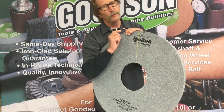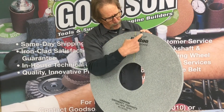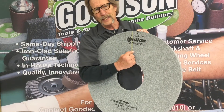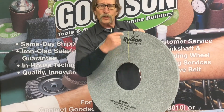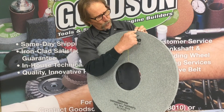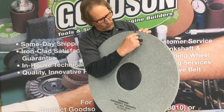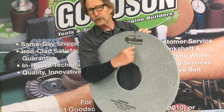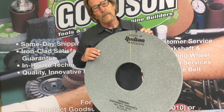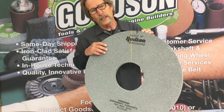A good reason for that recess is also the fact that your crankshaft grinders have about a four inch travel of grinding on these grinding wheels — you can grind about four inches down, and that's by the design of that machine. So when you side dress this wheel, because it will need to be side dressed periodically during its life, instead of dressing from the face all the way back down to the hub, with the recess in here we're only having to dress to about this area here. So it's going to save you time, it's going to save you money, because you won't be wearing out that very expensive multi-carat dressing diamond you have for the crankshaft grinding.